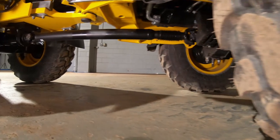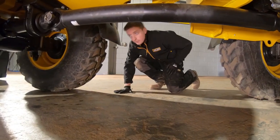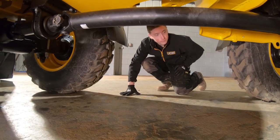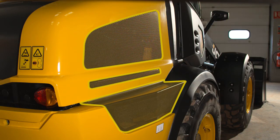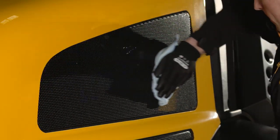Check for oil, fuel and coolant leaks below the machine. This also ensures you have checked no one is working under the machine before beginning operation. The mesh on the engine cover prevents larger particles being drawn into the cooling pack. If material does build up on the mesh, always clean it off when carrying out your inspection.